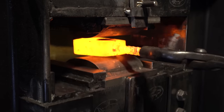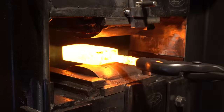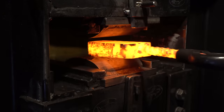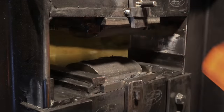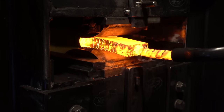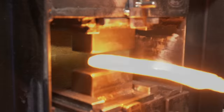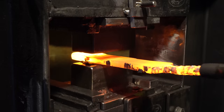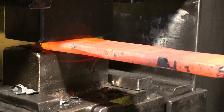And now, as always, the most stressful part of any Feather Damascus build — that's drawing out the billet that's been reforged. The reason this is so stressful is that you're putting a lot of force right where the billet was forge welded, so it tends to split on the edges and you have to keep grinding those out between every heat. Here, this is what I'm talking about — you see this split right here? This has to be ground out before the next heat.